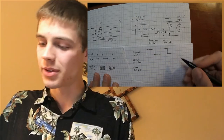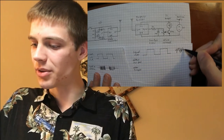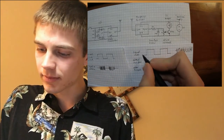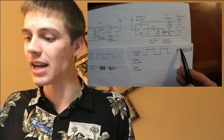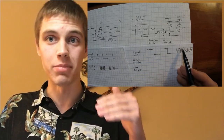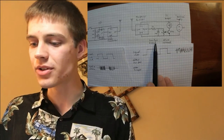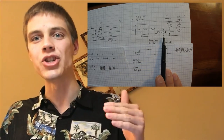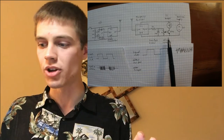But when you have this signal, this is what I'm assuming it looks like, and the noise, because it is amplified by this auto gain feature, is on par here. So the highest extent is going to be about the same, and I don't know exactly what it looks like, but maybe it's sort of a random looking thing like that, and it's about as tall. So this goes between 0 volts and whatever the max is, and this goes between 0 volts and whatever the max is of the auto gain, which means that you can't just take the peak voltage and say, is it on, if the peak voltage is above some level. So I use what is really two stages of really simple analysis. First, a low-pass filter, and second, a trim pot that is just there to put in a tunable attenuation of the signal before sending it into a transistor, which is functioning as a pure switch to turn on the buzzer.